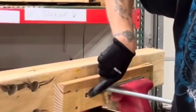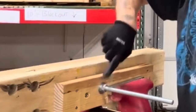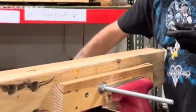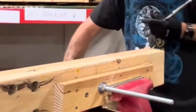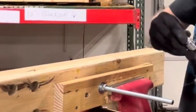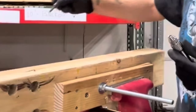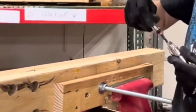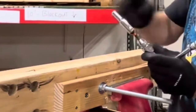Now take a look at that one. That one's recessed, and it might even be so deep I can't get one of these sockets on there. So all I have to do is take this adapter — which is a quarter-inch hexabit adapter — and throw on this Milwaukee Shockwave 3/8-inch drive socket adapter. Now it becomes a standard ratchet with a deep well socket.